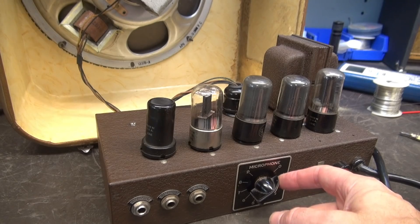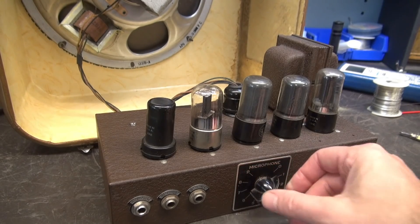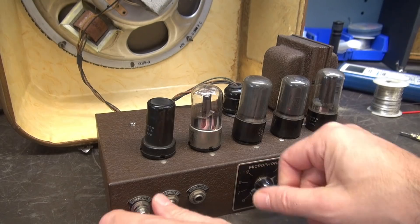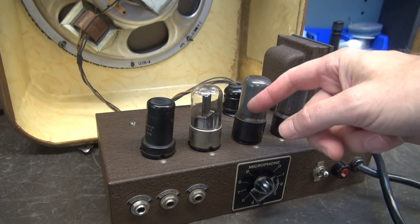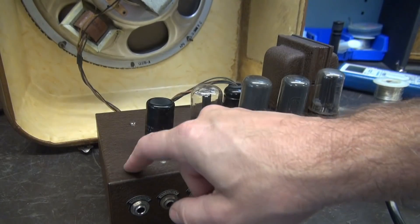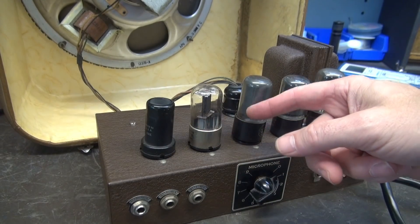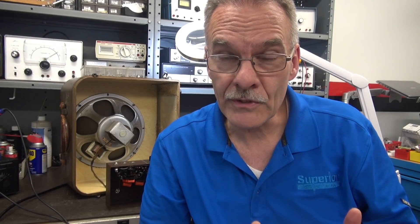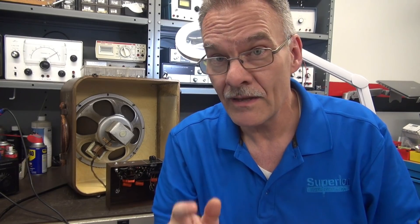There's our idle noise with volume all the way down. Let's see if it's really amplifying anything. We've still got some sensitivity, but it's not here anymore — it's over here, which could be some flaky output tubes. So the Gibson is coming along well. The noise levels are going down with everything we're doing. The input jack and the bad connections were pretty obvious. Next step, I'm going to change all the resistors and clean all these connections and rewire this thing the way it should have been done.